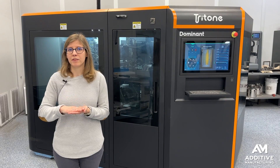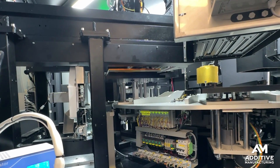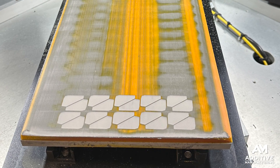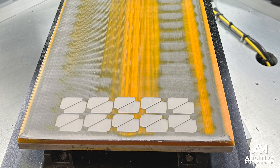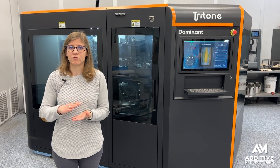The stencil is built up in layers that are 130 microns high, and then they are machined down to be exactly 100 microns. Then there is a slurry — a paste of metal powder with some additives — that is flowed into the mold to start building up the structure of the part.